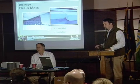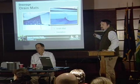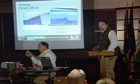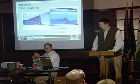In this system here, clearly some water is going through the little holes and getting around the insulation. Is it typically designed to go through the seams of the insulation or through the insulation? I would say that would be a waterproof rigid insulation, so that doesn't occur. See a little notch cut out right there, between the seams of that insulation. It has grooves, a drainage channel underneath to promote that water. They're cut in the bottom of the insulation to facilitate the movement of water.